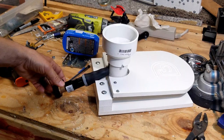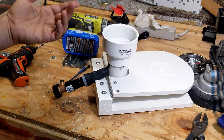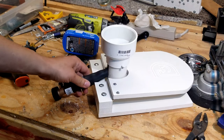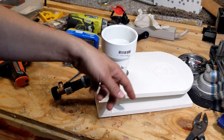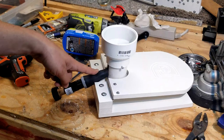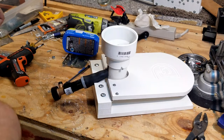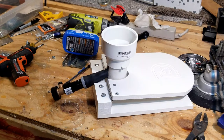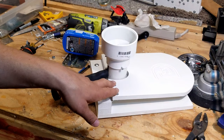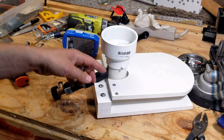This is a $5 part - this one's a little more expensive because it's brass, but that's a $5 part at Home Depot. This sprayer is a $5 part. I don't know why any of the rest of this would break. Back to my original point: building something that you assume eventually is going to get torn up - it might get chewed up, might look ugly - but if anything breaks, it's $5. If this sprayer stops spraying, basically undo one nut, take the sprayer out, buy another one, break the handle off like we did earlier, screw it back in, and the main functioning part is replaced. The ones I bought online cost $60 to $80, rusted out, worked poorly, and were unrepairable. So I figured I'll just keep fixing this one.